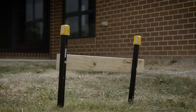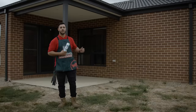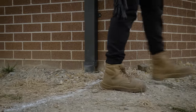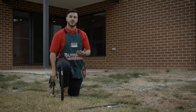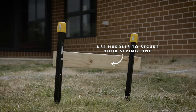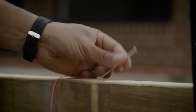Okay, here we are back at ground zero. The most important thing to do before you begin any construction is to set out your deck and check your measurements. Start by marking out your decking area with marking paint — this way you know exactly where to place your hurdles. It's a great way to visualise the deck and check you're comfortable with the size. Position your hurdles away from the deck to allow enough room to work. Use a string line to create the shape of your deck to your desired dimensions, then once your strings are in place, check your deck measurements are square.